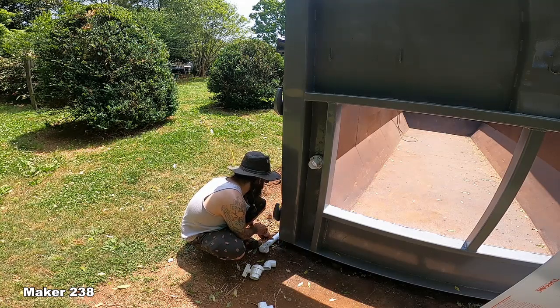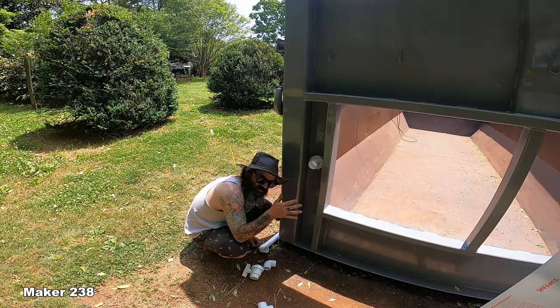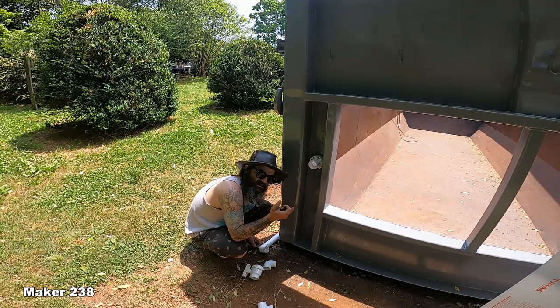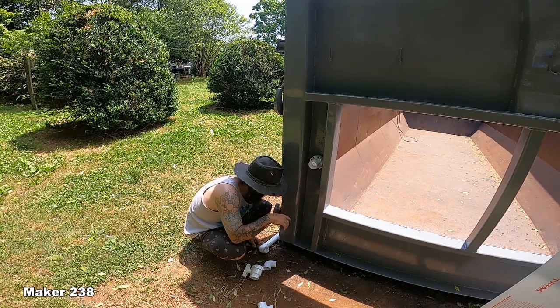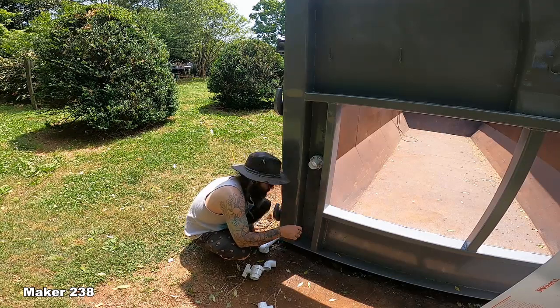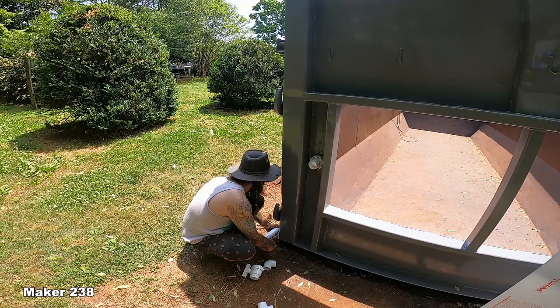I should put rubber. See, working on heavy equipment, you know, the vibration of the hydraulic hoses in the engine will eventually lead to it wearing through that thick, heavy hydraulic hose. I mean, that stuff carries 2 to 4 to 8,000 PSI. This is gonna have fluid running through it. It will have a light vibration. So what I'll probably do is put a little sticker or a little slab of rubber right there.